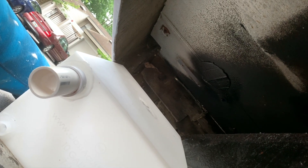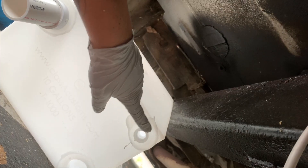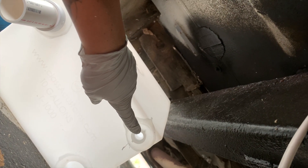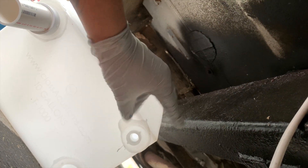I cut a piece of one-and-a-half-inch PVC, put it in there to connect everything, and then I'm basically done. I have some galvanized metal strapping to secure that. The last two things: the electric ball valve goes right here and should just twist on, and then I have a little piece where I'll attach a small nylon hose as the vent and overflow.